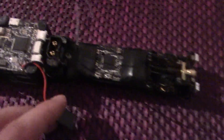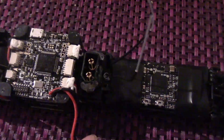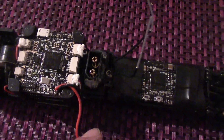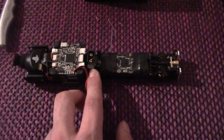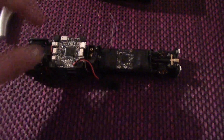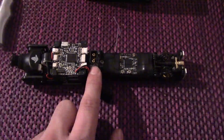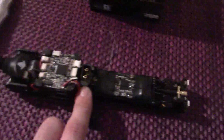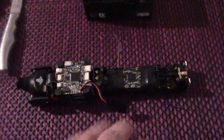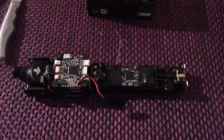The other thing I managed to damage was the XT60 connector and I have replaced that with a black one. Unfortunately the ones that TBS uses have a little lip on the bottom that sits under a black lock so it does not come out when pulling the batteries. These replacements did not have that and I did not realise until the old one was already out. I have used black to try to keep it in line with the rest of the build, but it is fine — hot glue keeps it in there and it seems pretty sturdy.